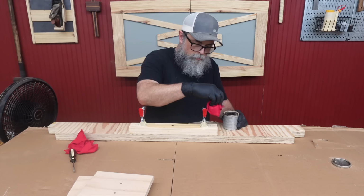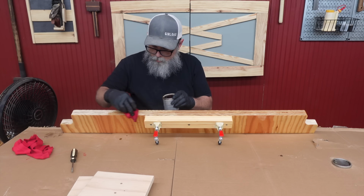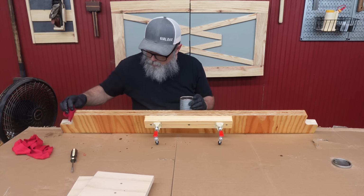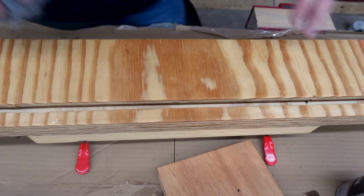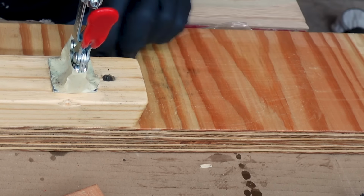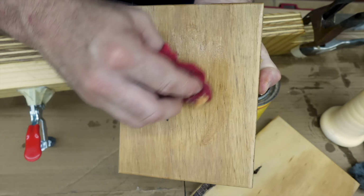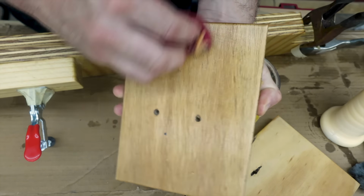For the finish, I'm using polyurethane and wax. Now the key to a good finish here is good surface preparation. The smoother you get the wood, the smoother your finish is going to be. Now, I could just cover this fence extension with a sheet of plastic, but when you think about it, polyurethane is a very thin sheet of plastic. So that's essentially what I'm doing. I wipe on one coat, then sand it back, and then wet sand in the second coat. After that, I apply paste wax and call it done. It's a nice, durable, smooth finish.